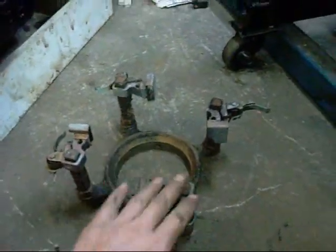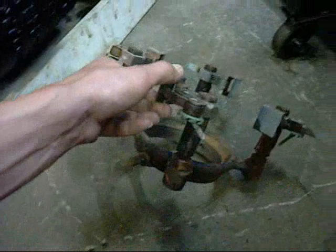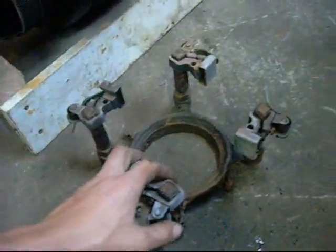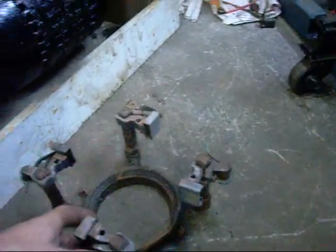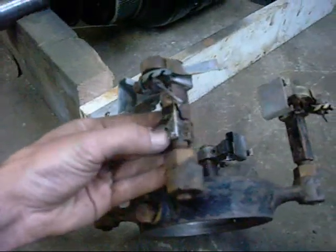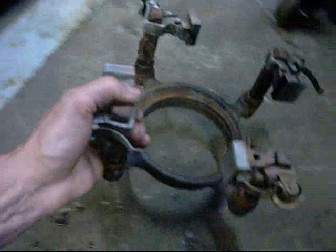I'll clean the whole collar up and make new insulation, and polish these brass boxes — all of this is brass apart from the springs and the screws. I'll polish that up and install them as they are. This collar assembly will be black, and for the insulation I'll go to the supplier and see what they've got in the way of either heavy wall high pressure heat shrink or some kind of mica insulation. I know mica insulation is a bit hard and expensive to find, but that's what they used here — this is all mica but it's just falling to bits. So I'll pull all this to bits and try and rebuild it.